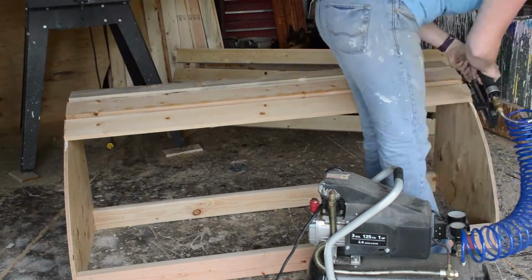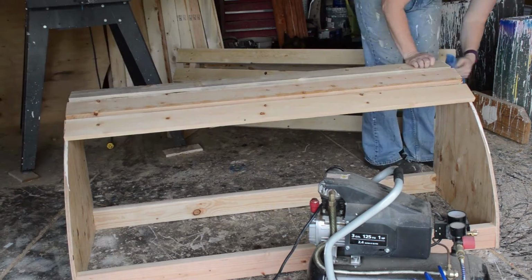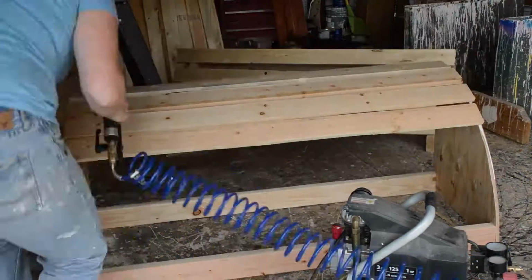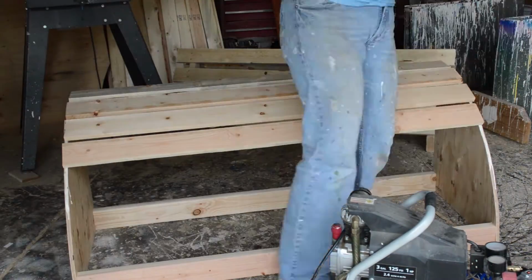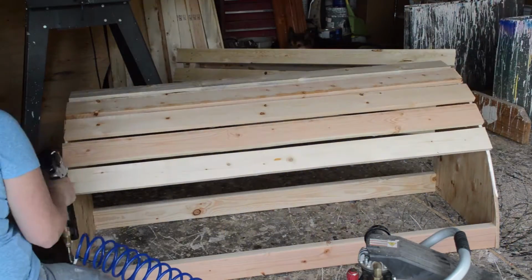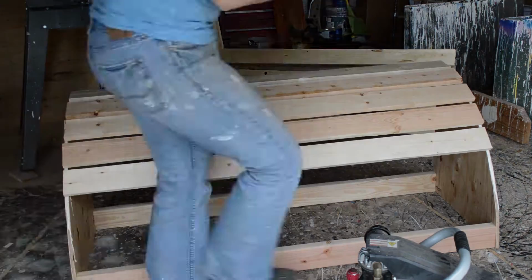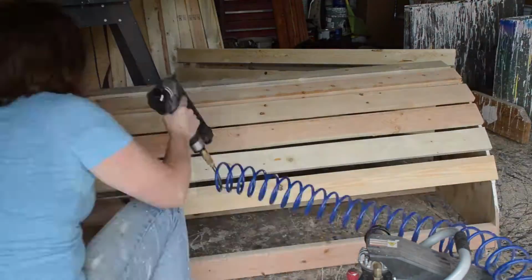And it's really important to make sure you have the nail gun lined up so that you don't come through either the inside or the outside of the roll top. And it isn't too difficult, you just have to really watch where your nail gun is lining up. And again, I used 8 pieces of the 1x4 inch wood. You can have spaces in it, that's okay, that's not a big deal, because you're going to be covering it. But if you wanted to leave it plain, you could.